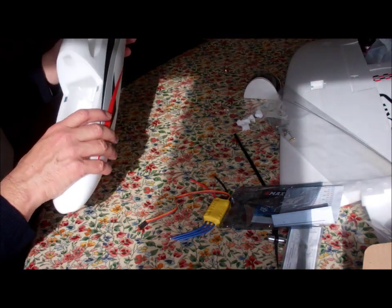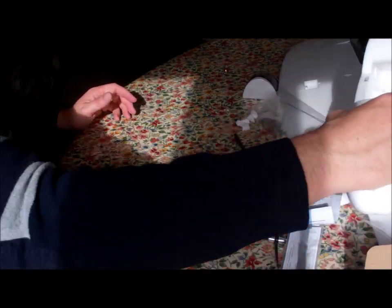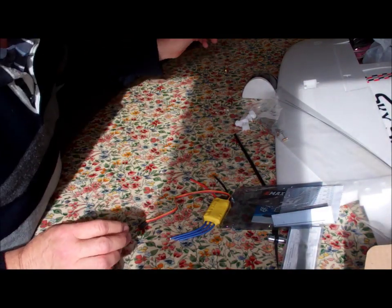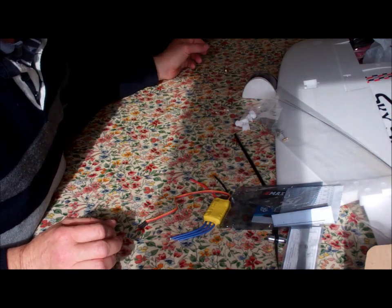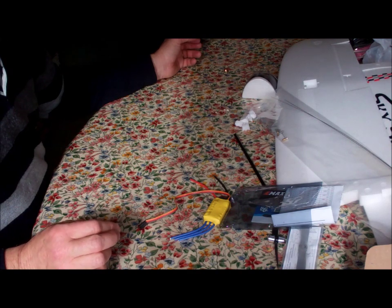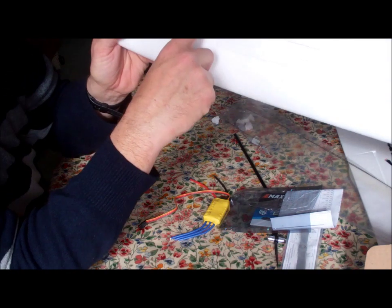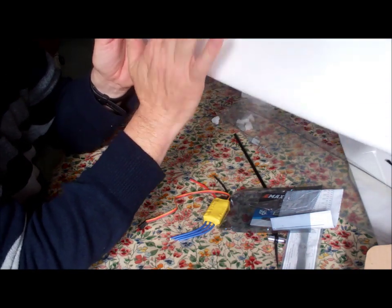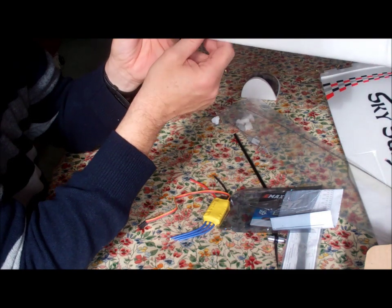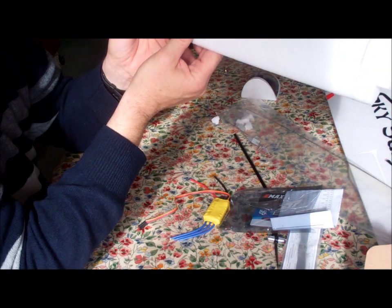And this next job is to think about putting some servos in it. Any of you subscribe to RC Model Reviews or aware of this site, the Mad New Zealander, Mad Kiwi, he recommends to hot glue the servos in, which I think I'm going to try and do to see if it actually works. Because I think if you use servo tape in here, then it's going to make the servo stick out, and that's not going to be good for aerodynamics. So Bruce just seems to put a dab of glue here and there, and it seems to do well. I might put a bit in there and then squeeze the servo in quickly.